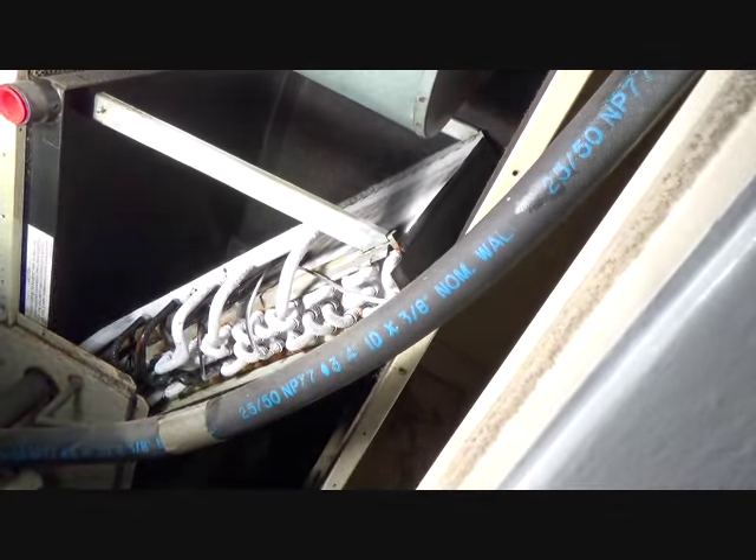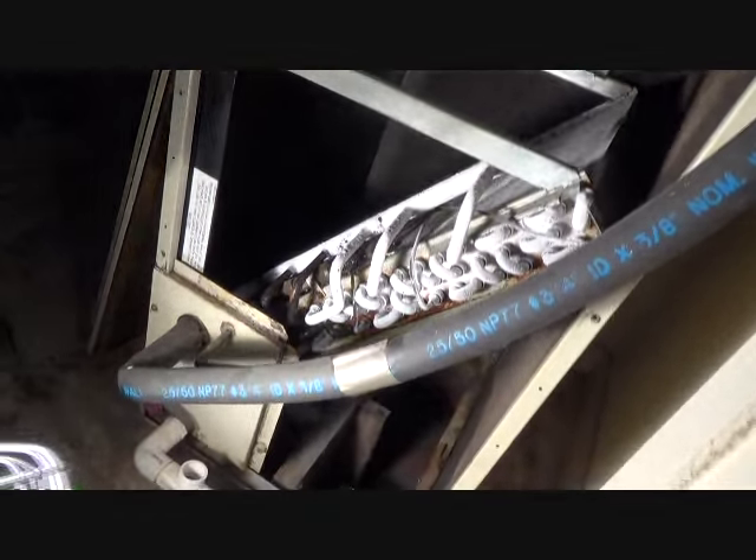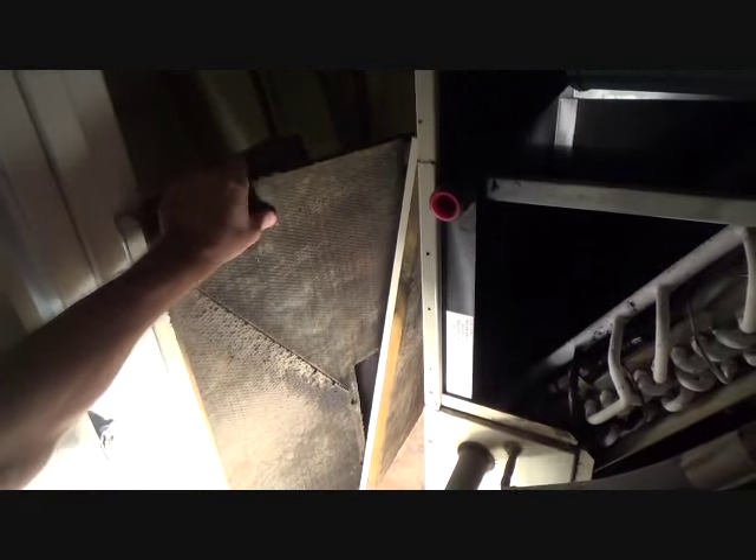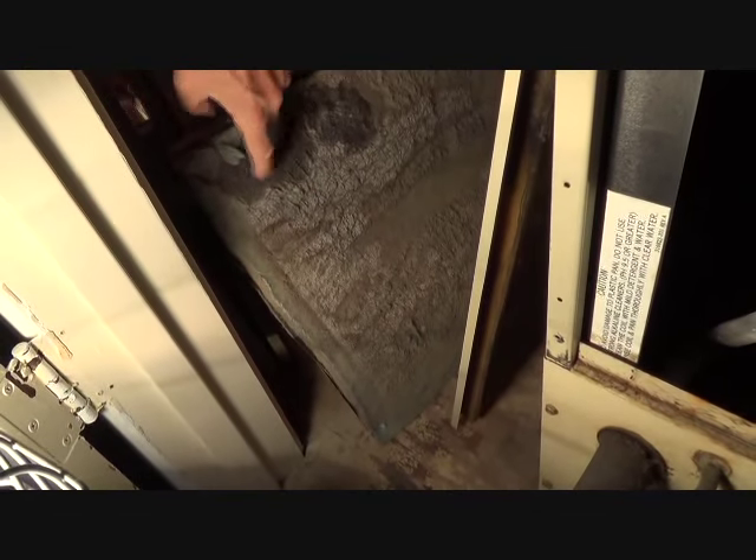This is all under pressure, and nothing's dripping so far. I look down here and the whole side of this is wet. This is just insulation on the side up here, and that was wet when I took this panel cover off. I'm looking at that, and this down here is moist, but it's just in that corner. Remember when I took this filter out, I flipped it around the other way — this is the only moist spot, and that's where it seemed to drip off, right down here at this corner.